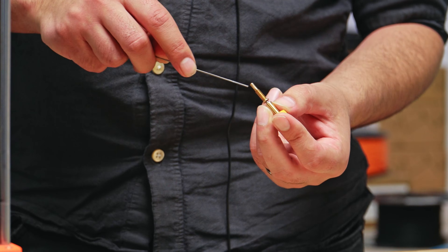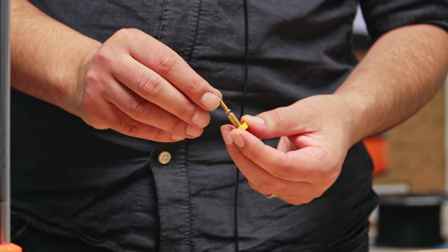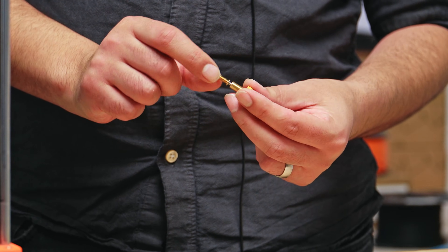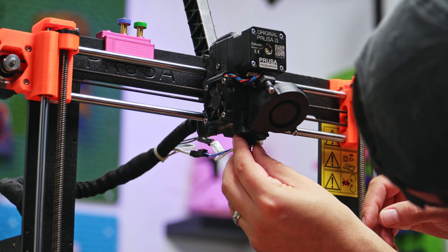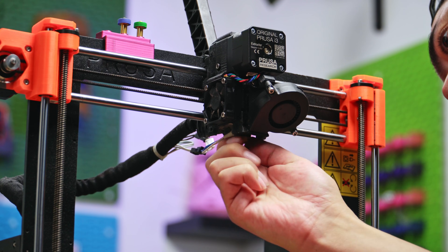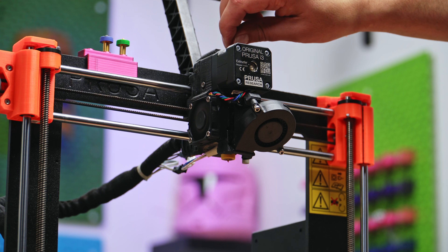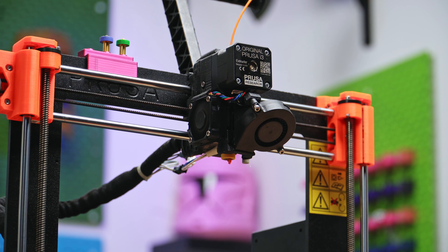This has been soaking in ethyl acetate for a while. The rod can now go a little bit further than before, but there's still a blockage further down. Hopefully that's just residue from the ethyl acetate, and putting it back in the hot end should let it melt out. Success! And that is how you unclog a 0.25mm nozzle.